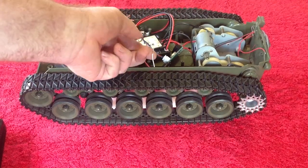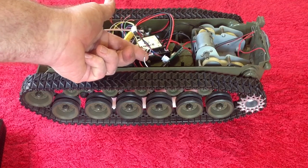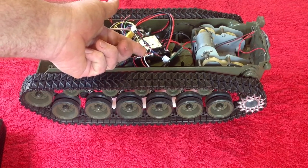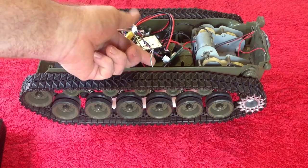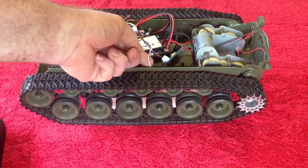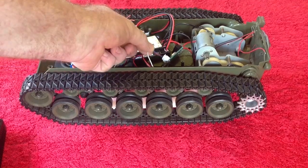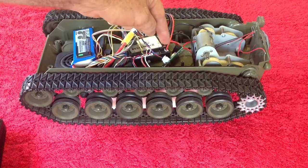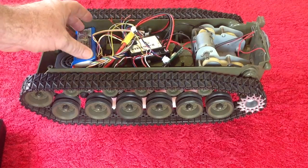What you need to do is just add a 1K to 2K resistor — the value is not important. I just happen to have 2.2K resistors hanging around, so I've added them in. You just put them in line in the signal line. There's information on how to do this on the forum, but once you have that resistor in the signal line, it will limit the current going into Komodo and solve 99.99% of the problems.